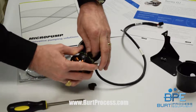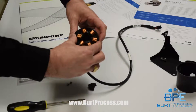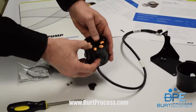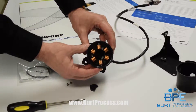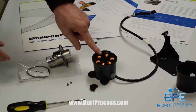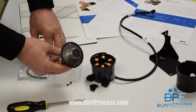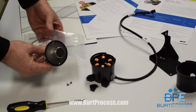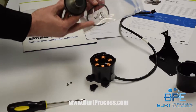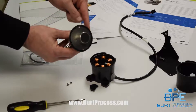It clips in — kind of like a USB — and we line up that slot with the ridge on the motor case. Now it's all back together. The coil floats for now, which is expected; it will get secured to the pump when we screw it together. There's a gasket here, so when you reassemble in the field you may have a spare.